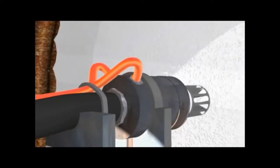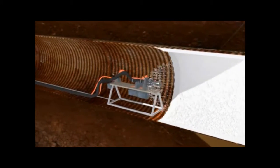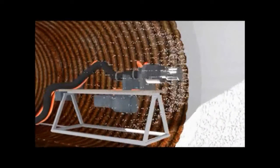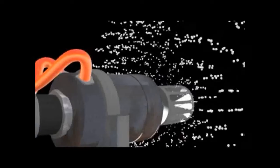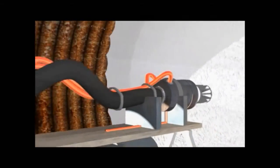The application shown here is an air nozzle. The sled is retracted through the pipe as mortar is thrown uniformly in all directions by the spin head. The oscillation shown here is useful in corrugated metal pipes to avoid shadowing. The thickness of the product applied is determined by the volumetric rate of pumping, the pipe diameter, and the retraction rate of the sled.